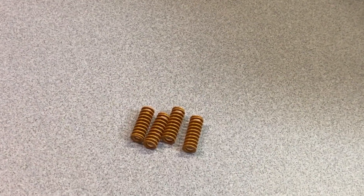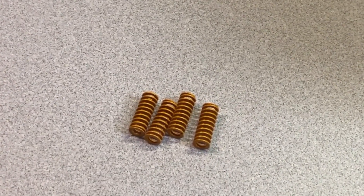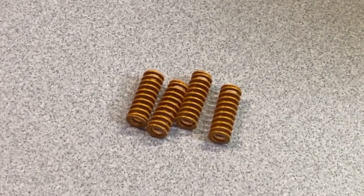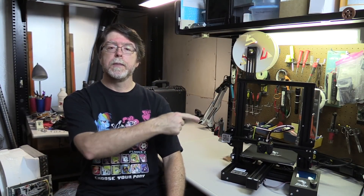Now yellow is a color usually associated with spring. I think the makers of these new springs may have taken that a little too literally, because these springs are yellow — kind of a darkish school bus yellow, but close enough. They're also supposed to be stiffer than the ones that Creality supplied with the printer, so that should make it easier to get the bed height adjusted properly, despite the default minimum altitude of the z-axis.